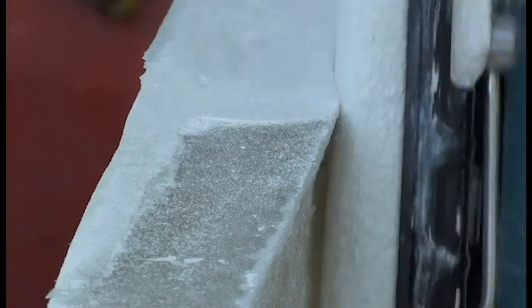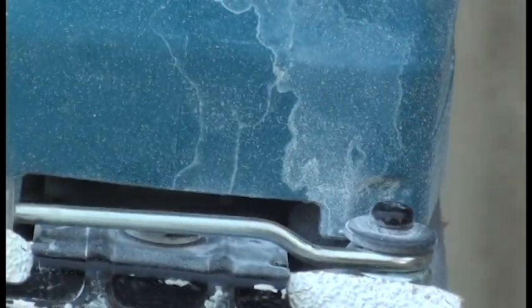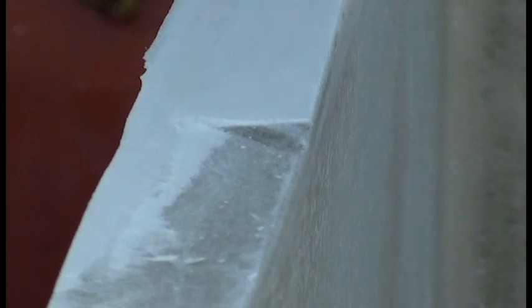Here's another detail about how quickly the 40 grit and the dual action sander takes down these overhangs. Virtually all the shaping of the parts is done with the 40 grit. And it's only when I've got my final shape established and I'm going to try and make the surface a lot smoother and hopefully shiny at some point, that I start moving up through higher grits of sandpaper.